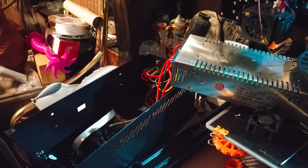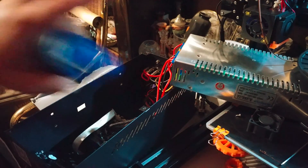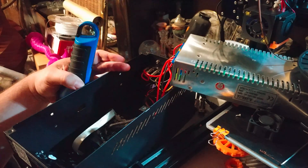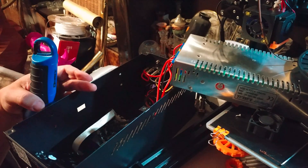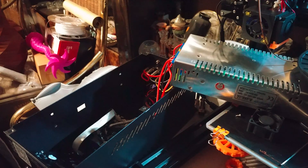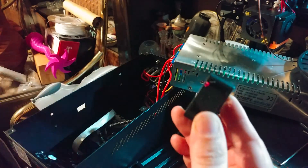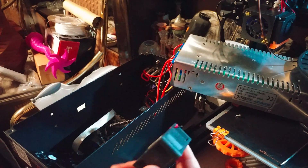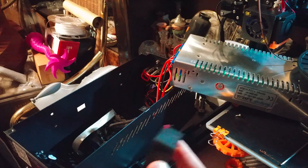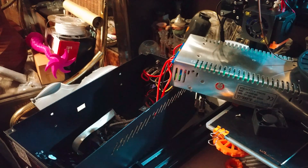When you replace the back fan and the center fan, they are hardwired — well, that one's hardwired; these two technically run to a terminal block. I just cut the old fans off and spliced in the new ones. You have to be careful: these are extremely tiny, thin, cheap wires with almost no wire inside them. When attempting to strip the ends it's a 50-50 shot — you'll just break the wire and tear the entire thing off. Be very, very gentle, or use a very good stripping tool.